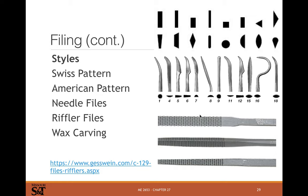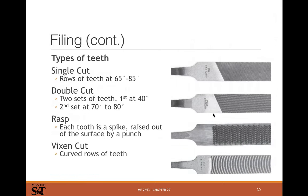Most of the time we're talking about just regular flat files for knocking corners off things and deburring. There's single cut, double cut, rasp style mainly for wood which doesn't work well on most metals, and Vixen cut. Single cut is pretty common and usually for finishing. Rasps are little spikes punched out of the surface and hardened, used for rapidly removing material mainly in wood. For metal we're usually just deburring or doing a little finishing work, so a finer single cut or double cut file is typical.